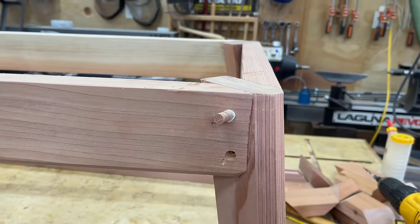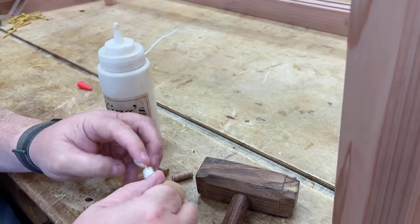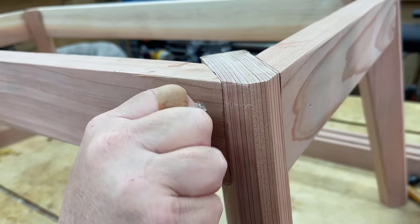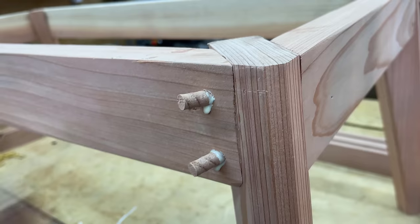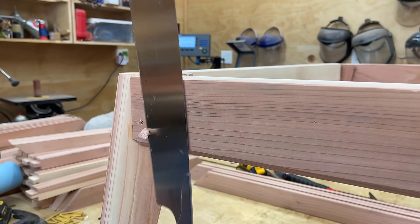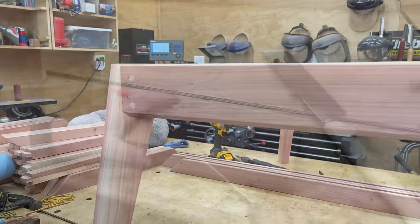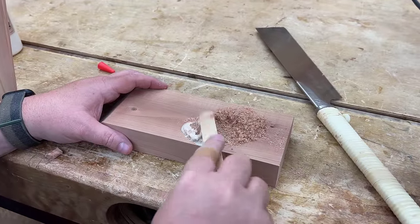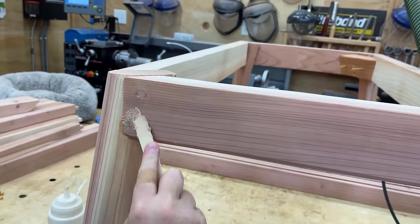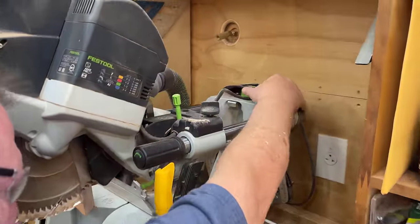We're going to plug the screw holes. My daughter cut the plugs with a plug cutter and a drill. We'll glue them in — to make them look good and kind of disappear, you should try to line up the grain to go horizontally like the grain on the rail. That helps it not stand out quite as much when you're sanding and finishing. Once the glue is dry, I'll cut it off with a Japanese pull saw flush trim saw. I'm also making some putty — for outdoor softwood like this redwood, I like to use coarser sawdust. I'll put that putty on, let it dry, and then sand it off.